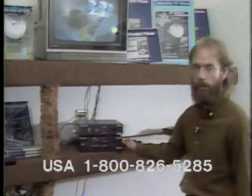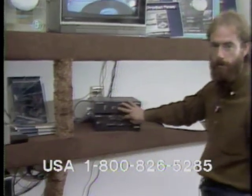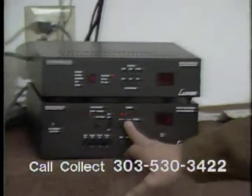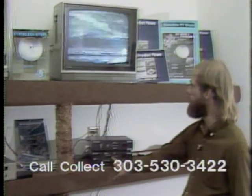Now I will start out by programming from the bottom end on up. Dial up channel 1. Initially, you will get nothing but snow. We have the 2 tuning buttons on the front of the Luxor 9550. The left one will tune downwards, and the right one will tune upwards. Now I will go down below all the channels until I have nothing but snow. Okay, I then start coming up, and I know that the first channel I hit will be either 1 or 2, depending on which polarity I'm on. Okay, I find the first channel I hit and verify that it is Nickelodeon.